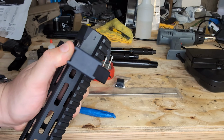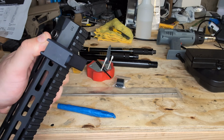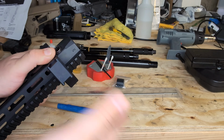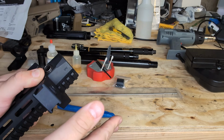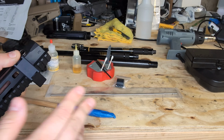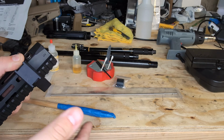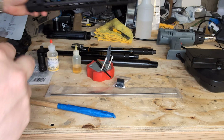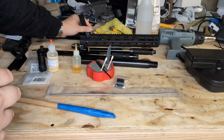So you would hand tighten this down, keep shimming it until you get to that position A, 11 o'clock position, and then torque it the rest of the way. But if you torqued it up to top dead center without 60 foot-pounds, you need to take it all apart, start again, add another thinner shim just to be able to get that minimum 60. And again, we're trying to aim for a little bit higher.